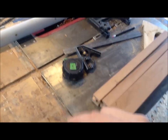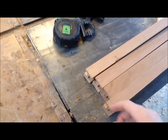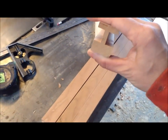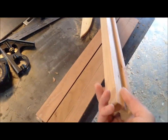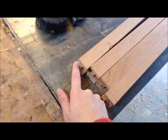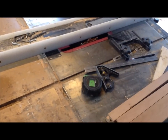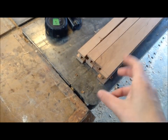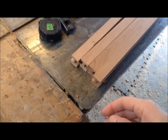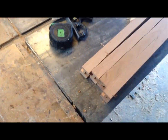I reset my dado stack the exact same way - measured the depth and distance off the originals and cut those. That middle partition is pretty thin, but since this is such thick cherry there's no give to it - it's pretty solid. Ideally I would have left the middle part a little bit thicker. These are half-inch grooves; I probably would have made them a quarter inch, but I was being a little hasty trying to cut everything on the dado stack without having to switch back into it. Luckily I can roll with this - it's not going to compromise the structure, but if you're doing this I'd make the partition a little bit thicker.